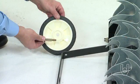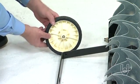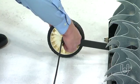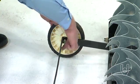Next, you'll assemble the wheels to the axle bracket using a shoulder bolt Part A and a 3/8 inch nylock nut Part F in each wheel. Insert the bolts through the outside of the wheel and into the holes in the front corners of the axle bracket. Then securely tighten the nylock nuts on the shoulder bolts.